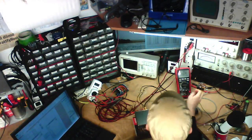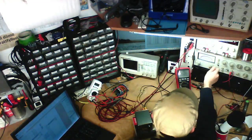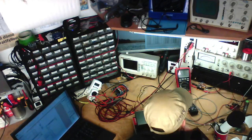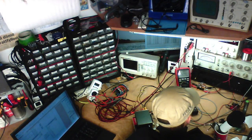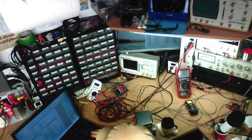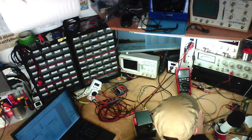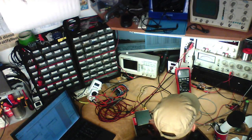500 millivolts, left channel, milliwatts, and that's 2 volts into 8 ohms. So we want to swap input ranges. And we've got 0.028% total harmonic distortion and noise on the left channel at half a watt per channel. Right one, 0.026.